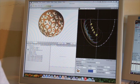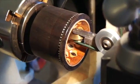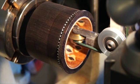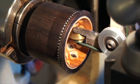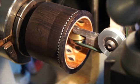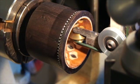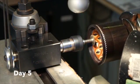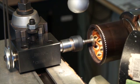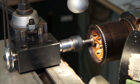The interior pattern is carefully designed on computer simulation. Then we take it to the Ornamental Lathe and cut through the thin layers to reveal the contrasting patterns of wood. After doing the same on both the top half of the egg and the bottom, we're ready to cut threads on the ornamental lathe to have the two pieces of the egg fit together with threads.